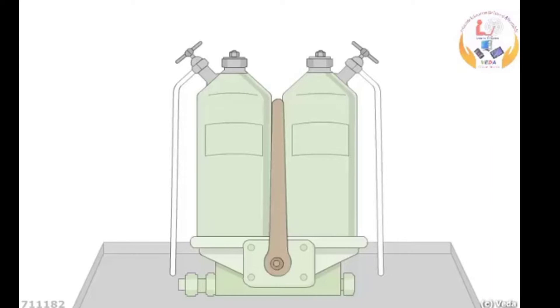Moving towards the first question — how to clean the duplex filter and do a changeover. As you may have seen these filters on your ship, the lubricating oil system uses duplex filters where both filters are in use, and these filters are cleaned by blow-off during operation.